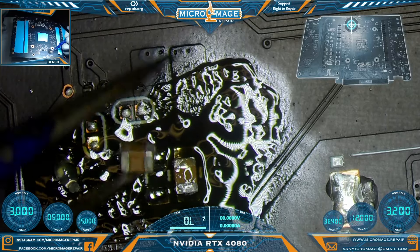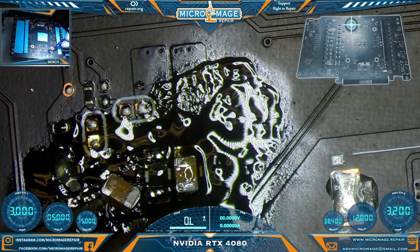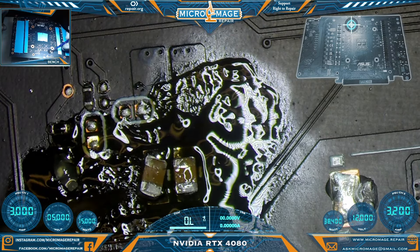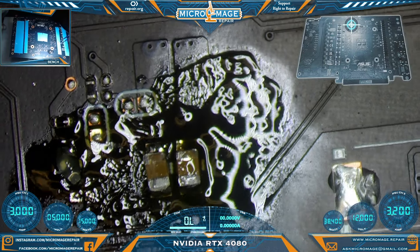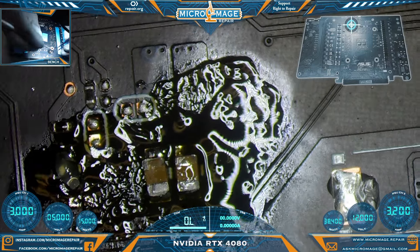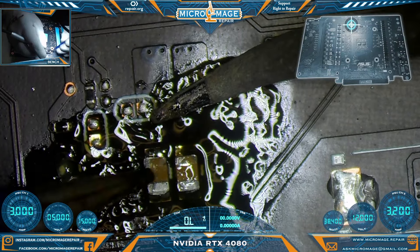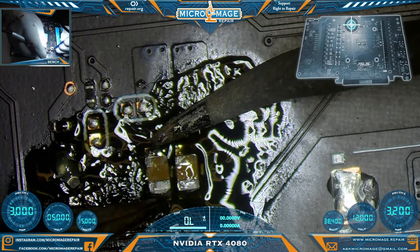One in place, need number two. We want the side with the ripped pad facing up. For those of you who have watched my channel, you know I've done a practical basic soldering of SMD components video — we are applying one of those techniques here. Not the most ideal technique, but with the thermal mass of this board it's the one that's going to work.